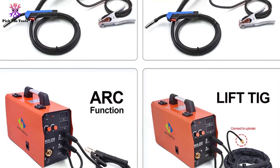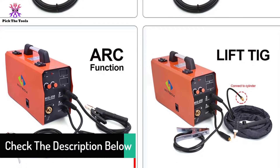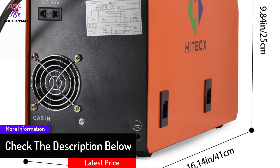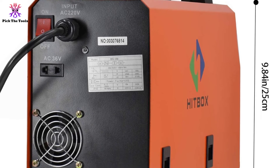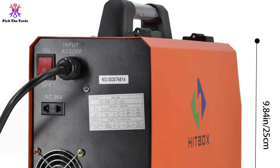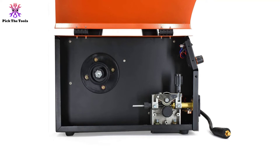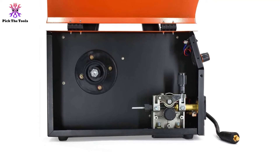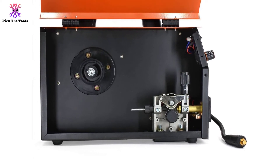This extra power provides the right amount of electricity to quickly and easily weld thicker metals. Of course, this also means that you need a heavier-duty 220-volt electrical outlet for it to operate properly, so bear that in mind before you make your final decision. Surprisingly, even though this model is so powerful and uses so much electricity, it is actually not that heavy. This makes it quite simple to pick up and move from job to job. You can also use this machine with or without gas, which makes it easy to use in lots of situations.